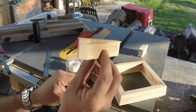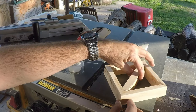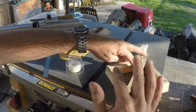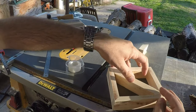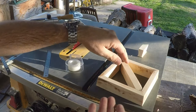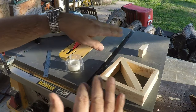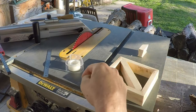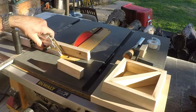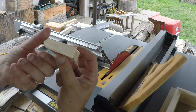I cut the first piece here — this side actually came out fairly well and it fits in there pretty good. It's not perfect, but we weren't aiming for absolute perfection; there's a little gap and we're going to have to put putty on this anyway. The other side has a pretty good-sized gap down here, but that's toward the bottom of the top so we're going to have to put putty and filler in there anyway. We'll need to make two more pieces to go across there and that'll give us our X-bracing.